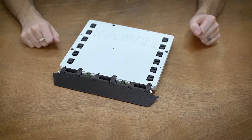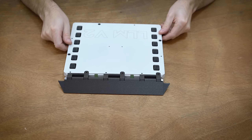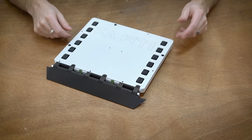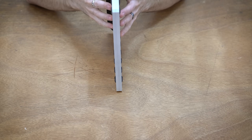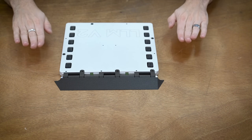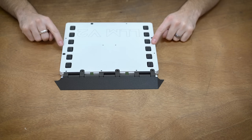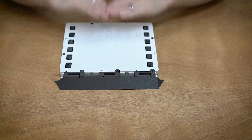This is the new Lolo Man version 2. Lolo Man is a 3-pound beetleweight combat robot and it might not look like a traditional combat robot. The idea for this started out as how low or how thin can I make a robot? To my knowledge this is probably one of the thinnest robots out there. The actual chassis itself is 14 millimeters thick. The wheels extend 3 millimeters top and bottom, so from the floor up to the very tippy top of the wheels is 20 millimeters. From the floor to the top of the frame is 17, and the cavity inside is only 10 millimeters — that's where all the guts fit.